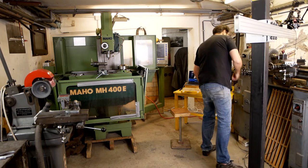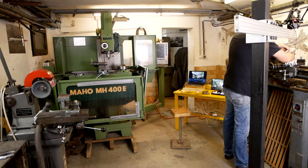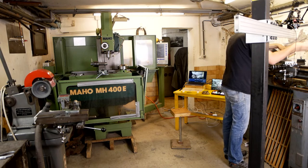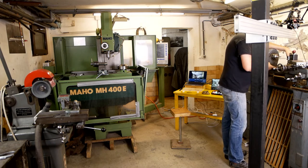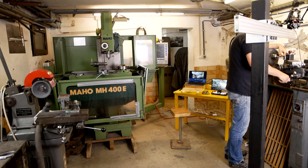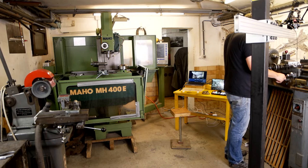Okay, it's now cool enough. Ten point four. Got this weird little drop off at the end by nearly 3/10. I wonder whether that's one of the burrs in the bed of this lathe. I have dressed them, but I'm wondering whether it's riding up on a piece of wear or something, because it seems to be transmitting that same bump into the work in the same place every pass.